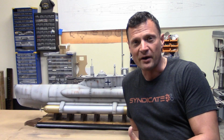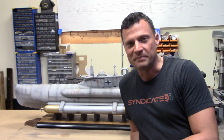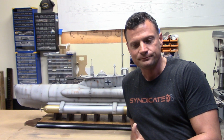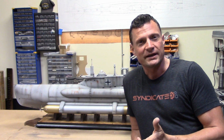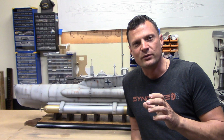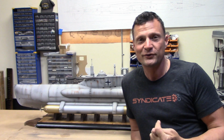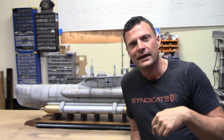As you saw, this boat can actually kick up a pretty tremendous wake. It's got a lot of speed thanks to the gearing of the motor and the shrouded propeller. In reverse, there's actually not a lot of thrust I found, and I'm not entirely sure why. Another feature, though, of that Kort nozzle in the back of the boat is that you maintain excellent steering response both forward and reverse, which is kind of a neat feature when you're trying to get turned around in tight quarters.